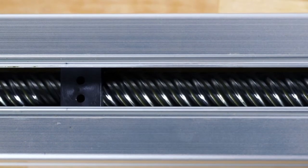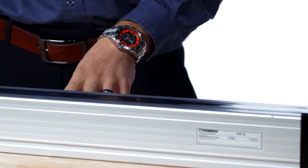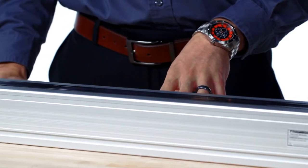On longer units, there are many screw supports that will nest in with each other as they travel along the stroke. With these screw supports, Thompson can provide ball screw driven units up to 11 meters in length.